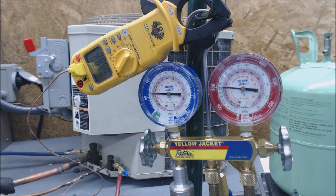We're at 0.8 ounces that we've weighed in so far. Temperature is 94.5. I'm going to add a little bit more. Our vaporizer is doing a good job — I don't hear the compressor complaining right now, because usually it will make a little whining noise if liquid was going to go in there. We don't want that noise.